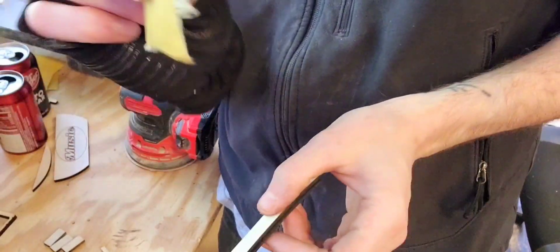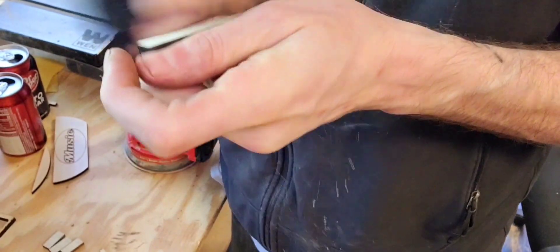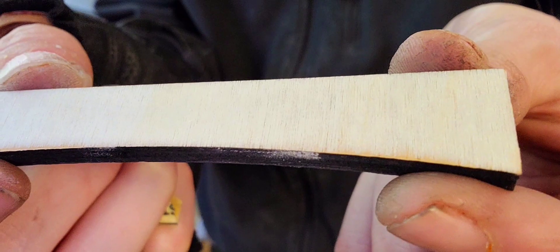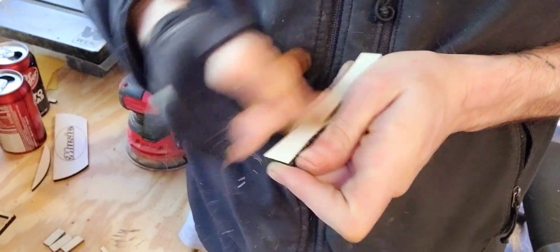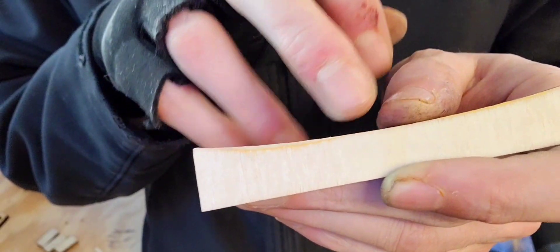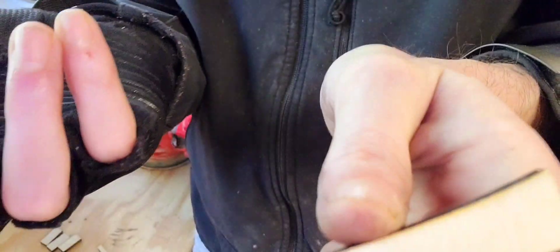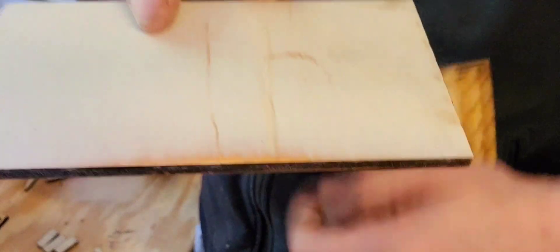Alright, so here's the wood. I'm just using some 220 grit sandpaper — nothing too crazy — trying to clean it up and make it look nice. You can start to see it on the edges: it's starting to turn, there's this nasty orange layer under this birch veneer. Where you're cutting, you'll get a lot more char around the corners, so you may have to hit it harder with the sandpaper. It's so bad — you can actually start seeing the translucence when you cut it, and there's just this really thick layer of soot that comes off.